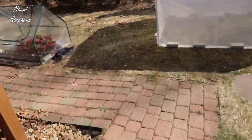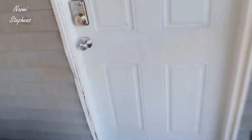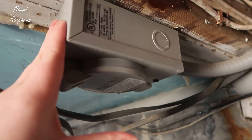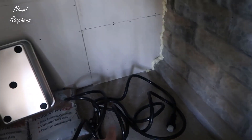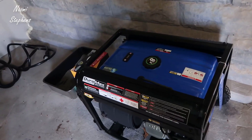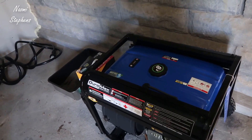Both breakers are connected off the main panel, and I was able to run a portable generator — this one is roughly up to about 13,000 watts — and that transfer switch worked perfectly. Coming in here to our basement area, we have this 50 amp connection up in the ceiling that the prior owner had put in. I'll open this port up; I have a 50 amp cable here that connects into that 50 amp. Then I take our large generator — this Duramax — which runs off either gasoline or propane.